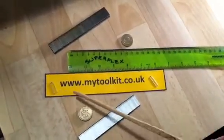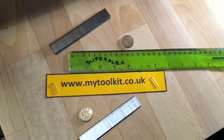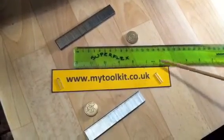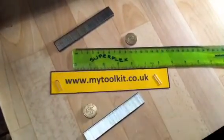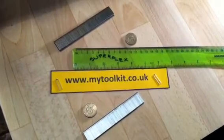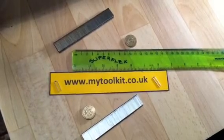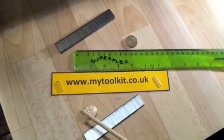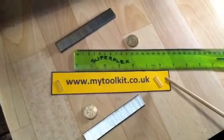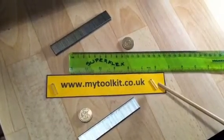As you can see, both these staples are very, very similar. They have the terminology 'narrow crown,' and as you can see there, the crown is that dimension across the top of the staple — the crossbar, if we're thinking of a goal post. Now, on the 90 series, that dimension is 5.8 millimeters. The 97 series, however, is a narrower staple and it's 4.5 millimeters.